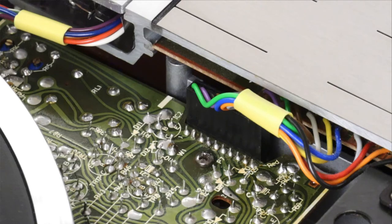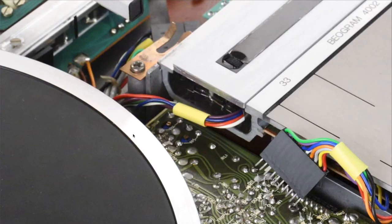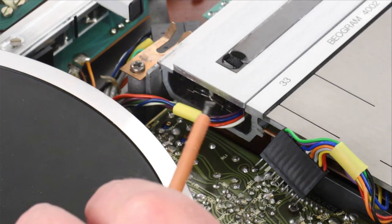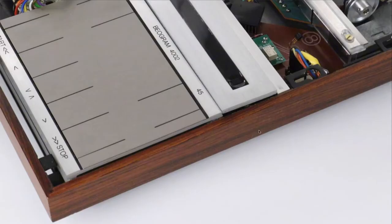The first step is to unplug the keyboard connector. The next step is to lift out the RPM panel, and for this we need to put a screwdriver into this gap. You need to be a little careful because these plexiglass plastic receptacles can easily crack, so be careful when you pry out these metal pins from these plastic parts. Use a soft cloth to protect the wood plinth and a smaller screwdriver to lift out the panel.